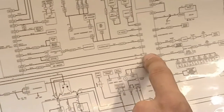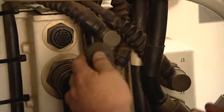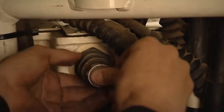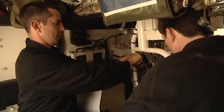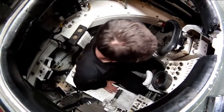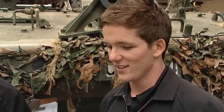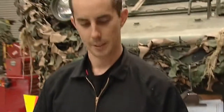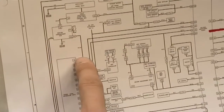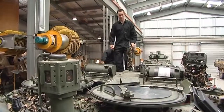We're going to follow this cable along and into the slip ring. Pull that cable off — that's 24 volts, so our fault's not there. Find connection J4 and measure the voltage. Does that feel alright? No, it's quite loose. That's quite a common problem, so we'll do that up securely and check for our fault again. Go ahead and jump in the gunner's seat. All power's working? Excellent — looks like we've found our fault. In here all the wires are bunched up together, but on the circuit diagram it's so simple — it clearly lays out all the systems, where everything goes and how the wires are connected.